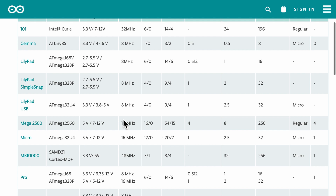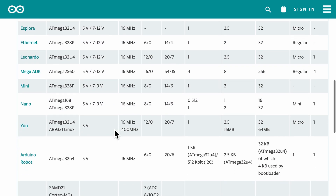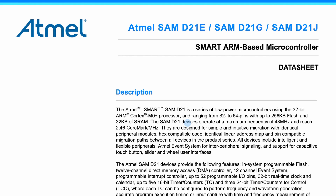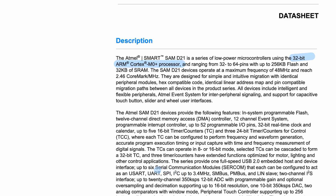For the very first step, let's get to know a little bit about the microcontroller, which is the SAMD21G in this case. Now Arduino has a lot of boards and many of them use the Atmega328P processor. But I needed a little bit more flash storage, and that's why I leaned towards the SAMD21, which is also by Atmel. Looking at the datasheet for the Atmel SAMD21G, we can see it is a 32-bit microcontroller with an ARM Cortex-M0 processor. It also comes with 6 SERCOM interfaces that can be configured as UART, SPI, I2C, and so on.